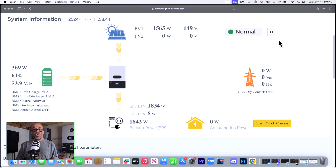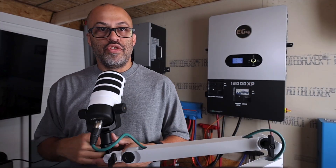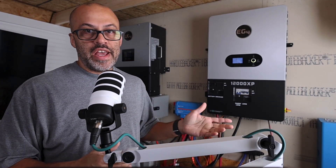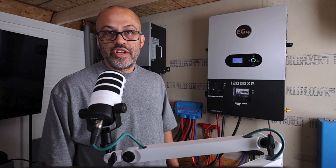We got a warning overload — warning 28 on the inverter. I think we're up to about 6600 to 6700 watts on leg one, and the inverter kicked out with warning 28, which is an overload. This thing is made to run 12,000 watts — 6000 on each leg — so when you get well over that for more than about five to ten seconds, it's going to shut off to protect it. I'm going to go back to the inverter, turn the EPS output off and then back on to clear it, and I'll turn all the heat guns off first before it kicks back on.